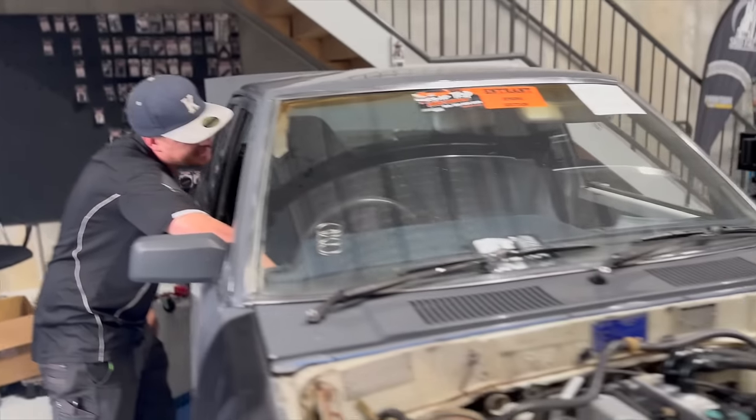What's the magic number? 28 pounds at the top there! How's that cooling pressure sensor looking? It's looking pretty good - come have a look. Man, it's wild on your ears - that four cylinder screaming. That's the run there. Even at wastegate some of that is restriction through the radiator core so you'll see a trend of it coming up with RPM.